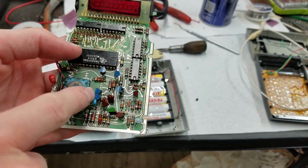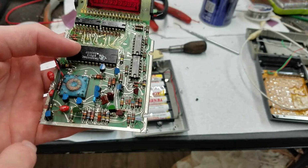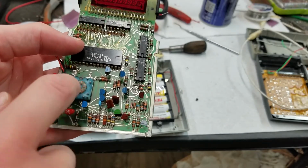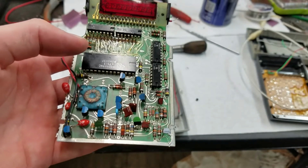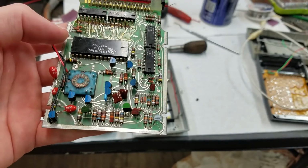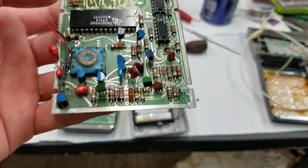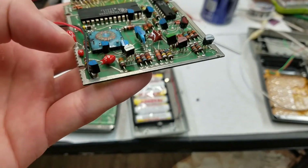These 2 and these 2 are the clock oscillator, and these 2, I think it's just these 2, as far as I can tell, are driving the transformer here for the power supply. And actually I was wrong. I thought that this developed all the voltages necessary, but it's actually not the case. Ground, as you can see right there, ground is connected right to battery negative.